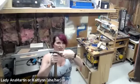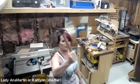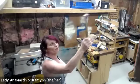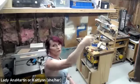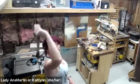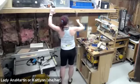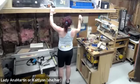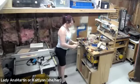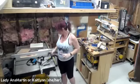The nail is stuck in here with the head of it up against the base of the hammer. And I throw the hammer this way once, boom, and then flip around and I can drive it again. And remember, I'm using the action of my wrist, shoulder and elbow all together to drive that nail in. I'm not trying to push it. I'm throwing the hammer at it. Trying to hit the nail the first time. Generally, if you look at the nail, that's what you'll hit.